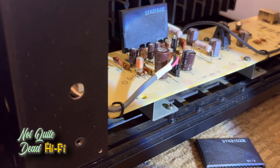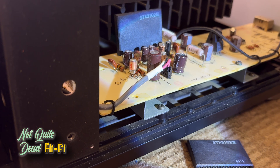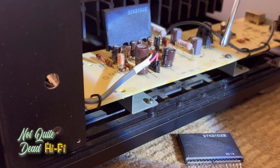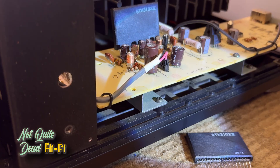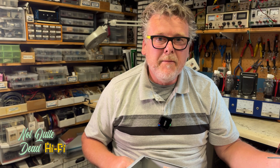There's a lot of money to be made fixing these old amplifiers, so it doesn't surprise me that people make fake versions. I was lucky and found a seller who had inherited an old stereo repair business, and I was able to buy two of these — I'm pretty sure they're genuine. The new parts are already installed, as you can see here. It's just a matter of a few screws to get the circuit board out. I like to use a vacuum desoldering tool on integrated circuits like this — it reduces the chance of damaging the board.